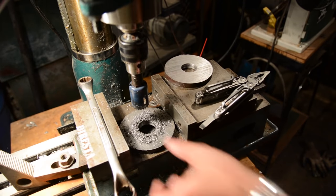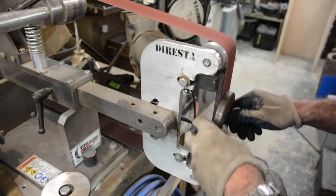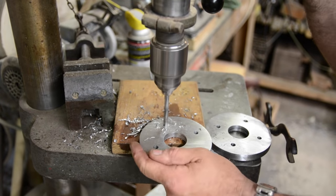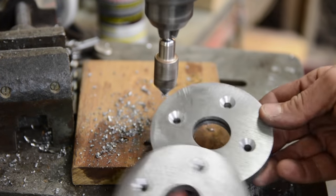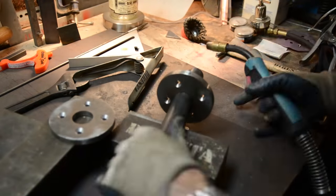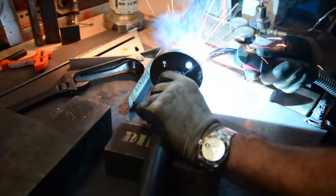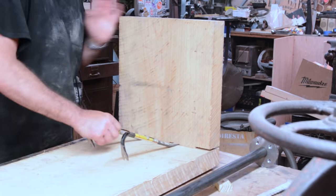That's my Rigid milling machine, which I very rarely use, but it's good for slow drilling. I thought I was going to cut those on my South Bend lathe, but my chuck isn't big enough for a four-inch diameter. Here I'm drilling the holes, jumping around them rather than drilling consecutively because the metal was getting too hot to hold. Then I'm doing the countersink, dropping in the screw, and welding on the flanges. The welds are pretty ugly but they'd be buried inside where they mount to the legs, so I wasn't too concerned — they're good and strong, just not pretty.